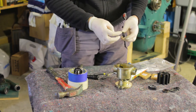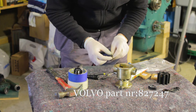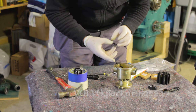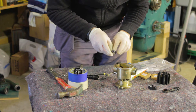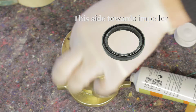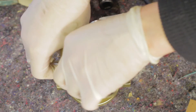Now it's time to reassemble the pump. Start with the sealing ring nearest to the impeller. Lubricate with a good quality grease to ease installment and secure a good seal. Make sure to turn the seal the right way — the visible spring should face towards the impeller on the first seal, but towards the engine on the last seal.